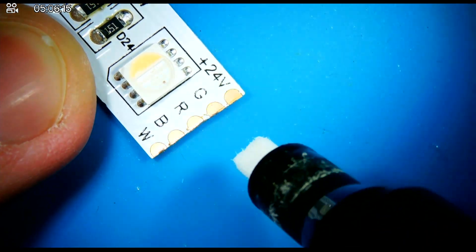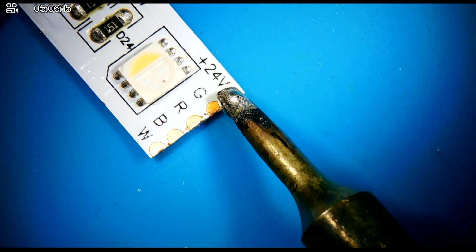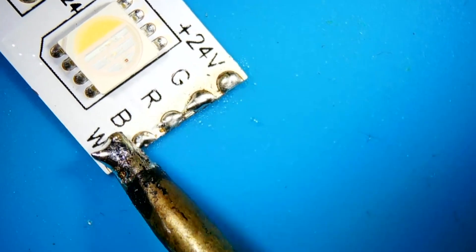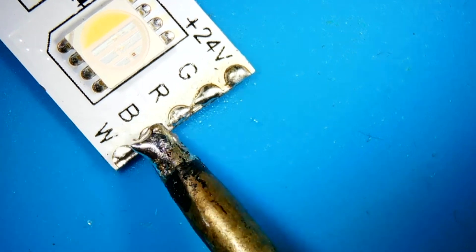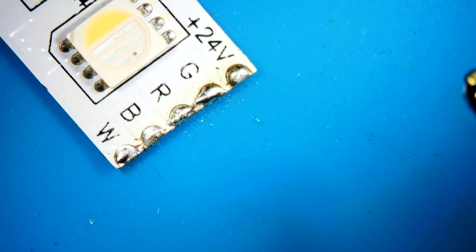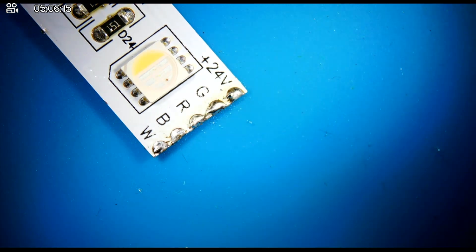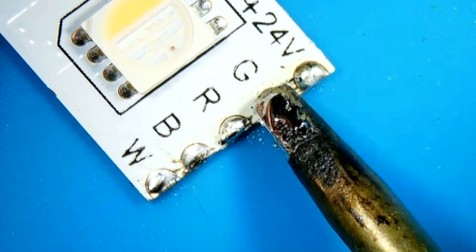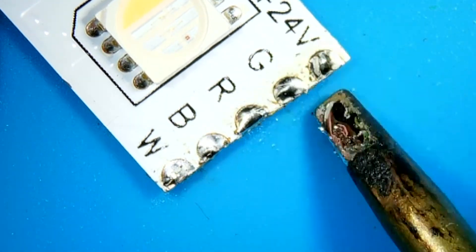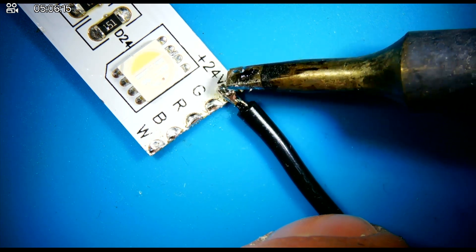Also when you stick them to the aluminum profiles, take care that there is no contact of the cables to the aluminum profile, because this can also cause a short circuit. Let's try the pen on this one here. I cover them up with flux a little, then I just go over them. With the flux it's super easy — just take care that there is no contact between them. Now I might have too much on my tip so I get this off and go over it again so there is no connection in between them.